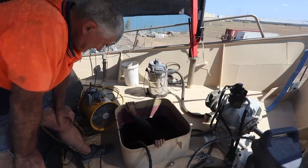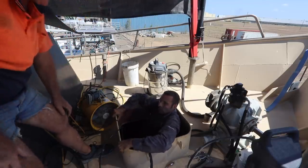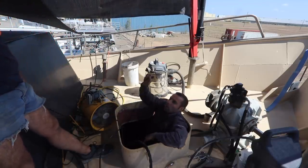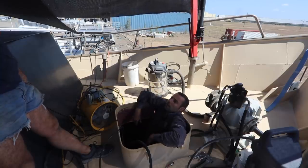I actually realise now I need a couple of 5-inch grinding cutting wheels. The 1mm cutting discs. Oh yeah? Because I'll cut all the straights with that. Alright. Yeah, because I'll get a straighter line. And then I'll do the corners with the plasma.